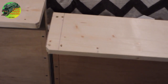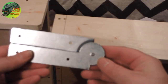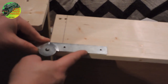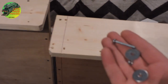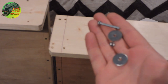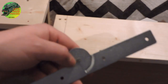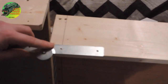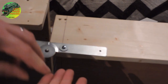Now that the two boards are complete I can attach them together. The hinge I've chosen is this one — you'll probably recognise it as the hinge you find on painter decorator tables. The hinge will sit perfectly with the two edges. I've already drilled two holes where we're going to attach it, and we'll be attaching it with two bolts, some washers, and the nuts, with an additional hinge on the opposite side for strength. We're going to have the ugly side facing inward. I've cut a little bit of the wood away to accommodate the protrusion of the hinge so everything lines up nicely.